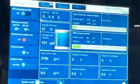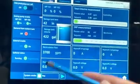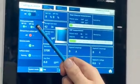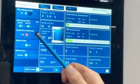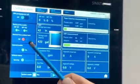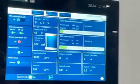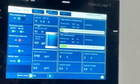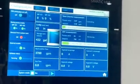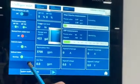With this button, we can go back to our main screen. This is the home screen, where we can start and stop production. We can start and switch off our dosing pumps. We actually see if there is demand to fill the oxidant or the storage tank. The status of the enable. The enable contact is a signal that an outside entity can place into our system to stop or start the production. The status of the softener can be running or regenerating.